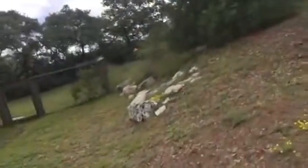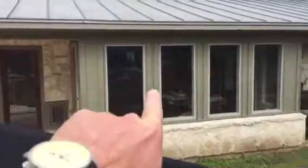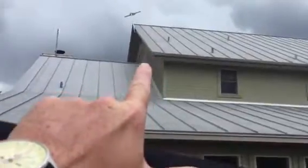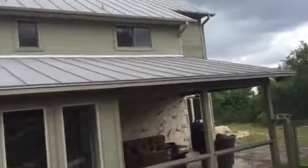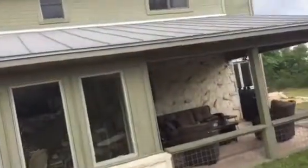All this trim under here will be Hardie plank. The porch ceiling is tongue and groove so we don't have to worry about that. On this little addition it's mostly window trim, with a few areas of siding in between. There's more gutter up there that will have to come down. That corner and this corner will require minor rot repair — that has to be done before we accomplish the fascia overlay. It's a gorgeous house and it's going to look nice with that board and batten.